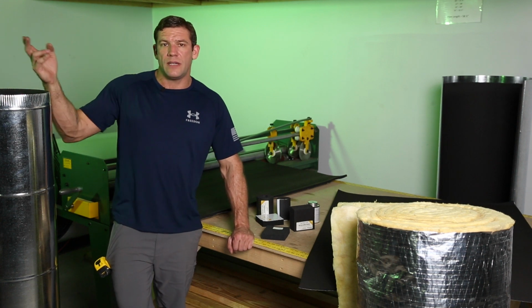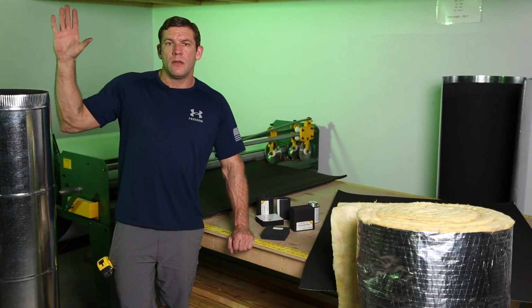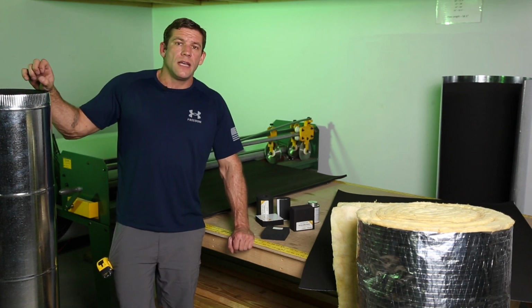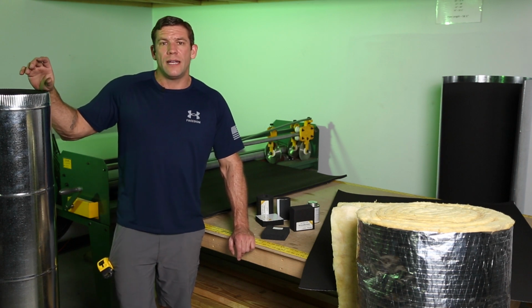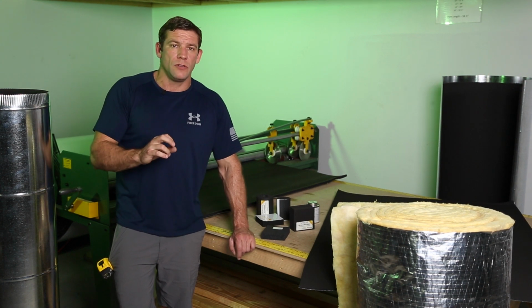Normally, the houses I'm doing nowadays are insulated with closed cell insulation, and every part of the house that is inside that thermal envelope is considered indirect conditioned space. I'll try not to get all stuck on codes and tables here, but ASHRAE outlines a lot about where and when you can use certain R values of insulation. And ASHRAE table 6.8.2, I believe, will outline what type of insulation you can use and what R value per what climate zone you live in.